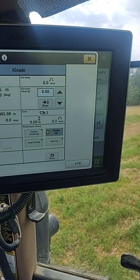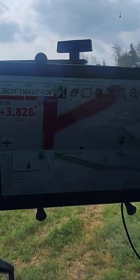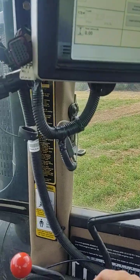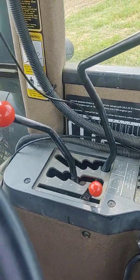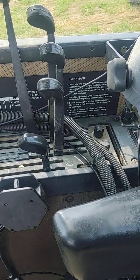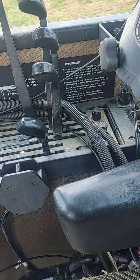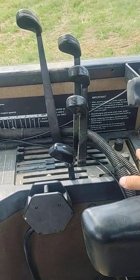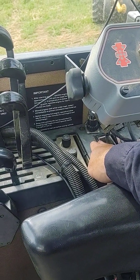The serial port here is the data coming from Terra. We have a USB-to-serial port adapter, and the serial port adapter goes back to that 12-pin plug on the UCC. Since it's a legacy tractor we added the cab harness with the ISO connector — that's a pretty standard installation. Beyond that we added the application controller, and everything is running through the three-pin convenience outlet because I teed all the power into the junction block in the wiring harness under the seat.